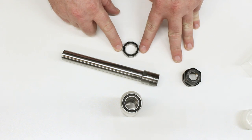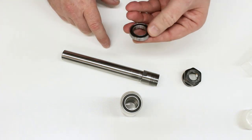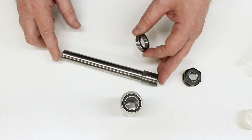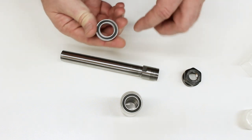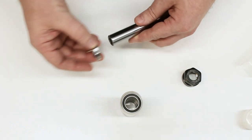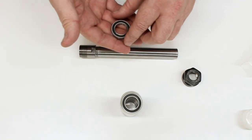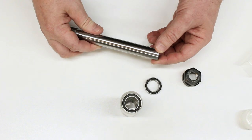The radial static load should be about 500 pounds rated, and with a deep groove bearing you should figure the axial load at about half that again — so these should handle at least 250 pounds axial load. There's going to be very little axial load on this since it's just going to be running a grinding wheel working on the side of the wheel, so this should be fine. These bearings have an outside diameter of 32mm and inside diameter of 20mm, so in theory they should just fit onto the shaft. In reality it doesn't work that way because the bearing and shaft are both very close to 20mm — it's essentially a zero-clearance or interference fit.